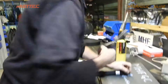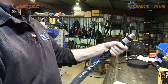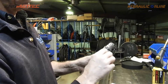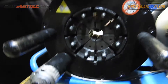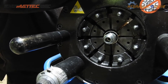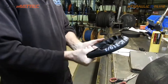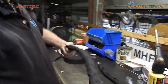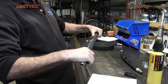We do the same with the other end. What I'm trying to show here is that as you bend the hose, the sleeve actually shortens and pulls back. We need to allow for that pull back when the hose is bending. That's why when the hose is straight the sleeve looks a bit wrinkly. It's a bit fiddly, but things need to look good if people are paying for stuff. That's one hose assembly done — this will convert jets and sprays into just an ooze through the weave.